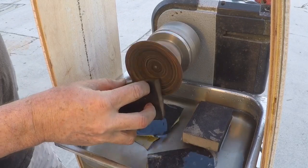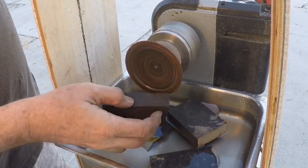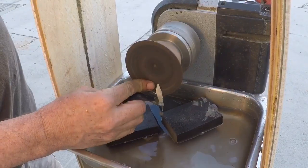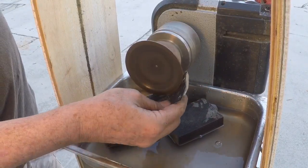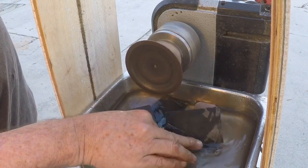The wet sanding process is really perfect for this plastic. Here I'm using a 120-grit sponge to get the tool marks out, and they do come out pretty quickly with wet sanding. I went up in grits in four or five steps up to about 4000 grit.